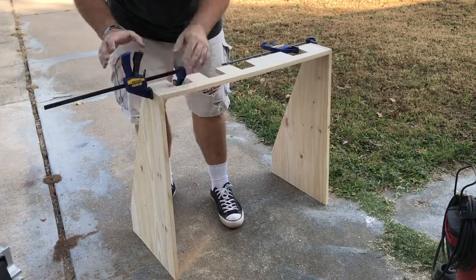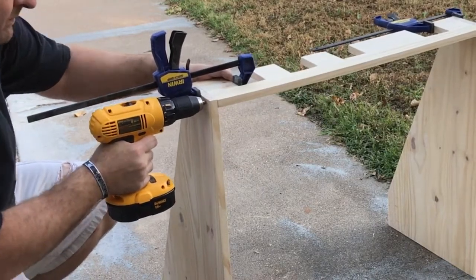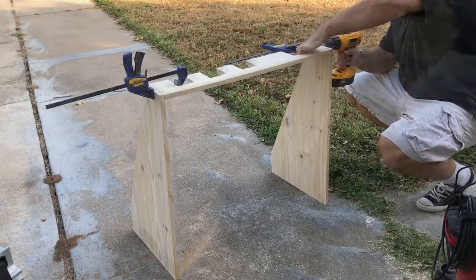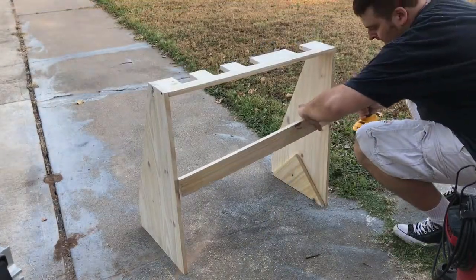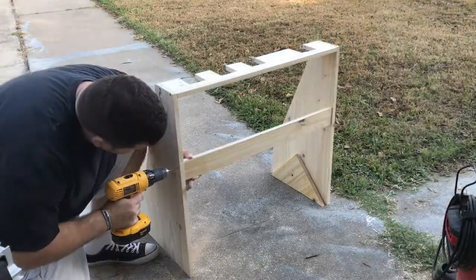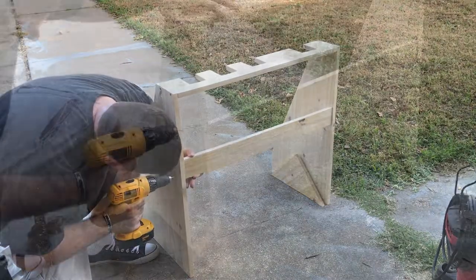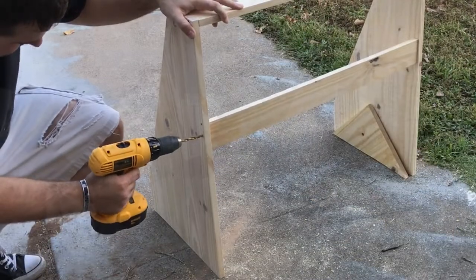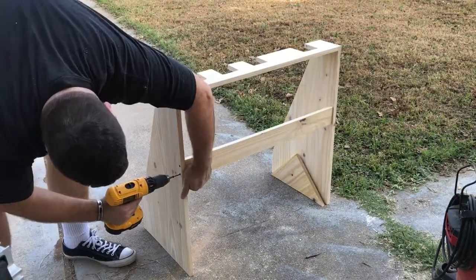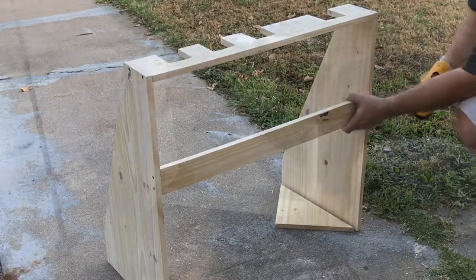Clamp's got a clamp, and I gotta drill. I'm in the habit of drilling pilot holes now these days, because I've split way too many boards — it isn't a big deal, just do it. I also always countersink, because nobody wants a screw head sticking out and jacking it up. I don't have a fancy drill bit that routes out a countersink while it drills — I just took the screw I was using, found a drill bit that was slightly larger, then after drilling the pilot hole, I'd switch out the bit and get down with screwing down. Too easy.